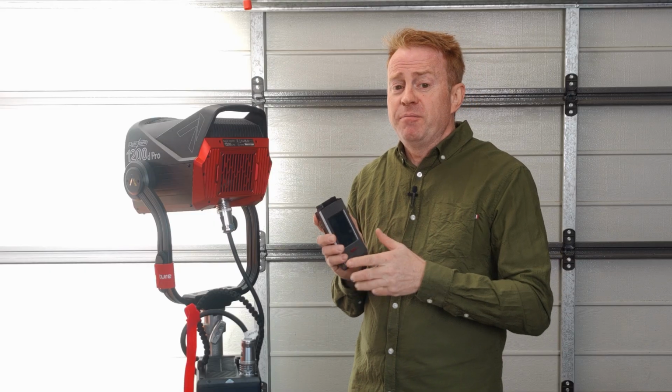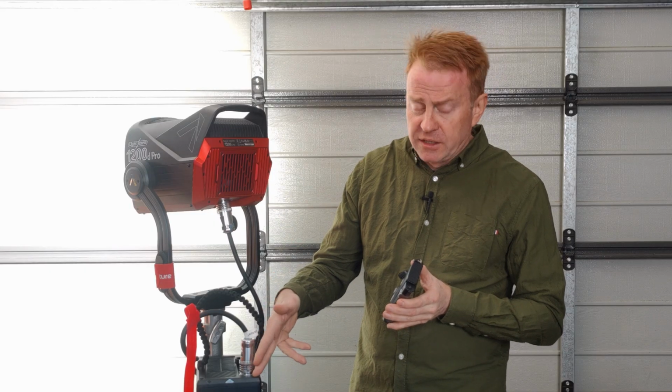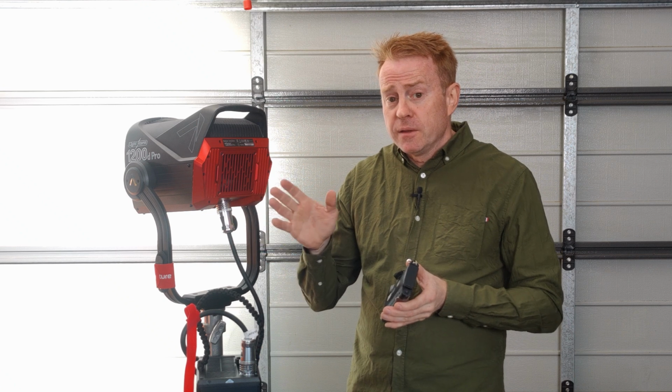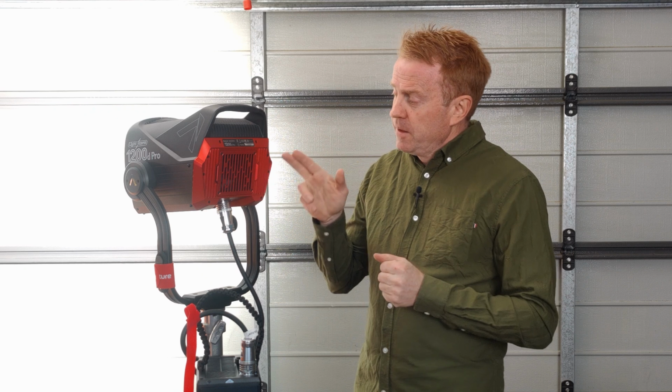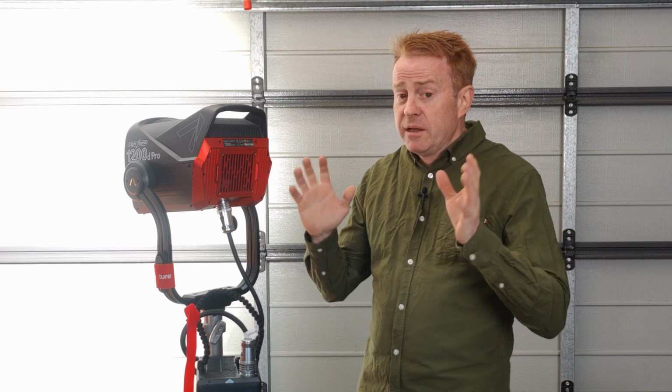Now, at 1000 FPS, with the frequency selector maxed out, the frequency meter was telling me that I've only got a 0.5% chance of getting flicker. Aputure also told me that the light is flicker-free at these frame rates. So here was the problem. At 1000 frames per second on set, this thing flickered like crazy. It was actually unusable. At 100% brightness, it was okay, but as soon as you touch the dimmer, it flickers to the point of being embarrassing.